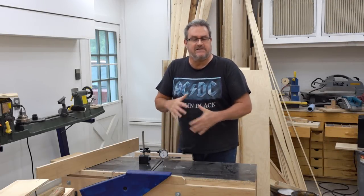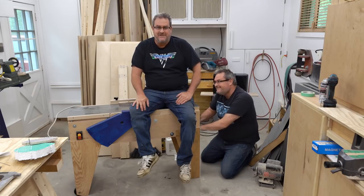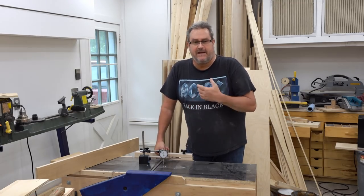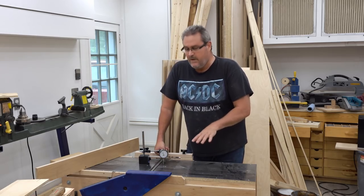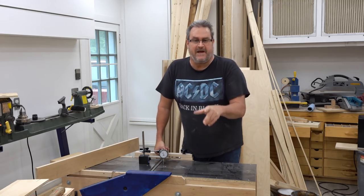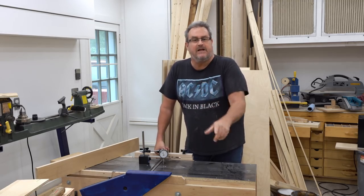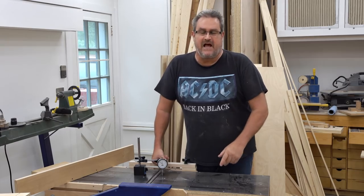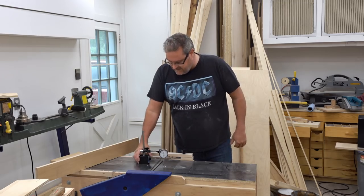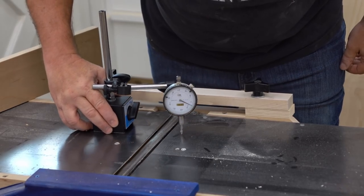I posted my latest video on the High Swandal Project channel this morning and it was about my jointer. In that video I said I've got nothing to prove with this, so I didn't go through the extensive tests that Matthias did when he showed how great his was. But he left me a comment saying put dial indicators on it and hit it with a hammer — so that's exactly what I'm going to do. Dial indicator set up here, base is on the outfeed table, I'm just going to slide it back and forth across the infeed to show how well that's lined up with the outfeed.